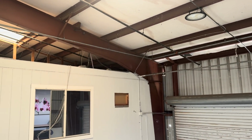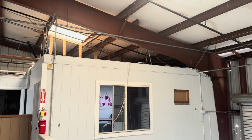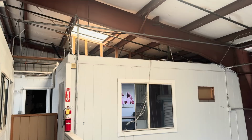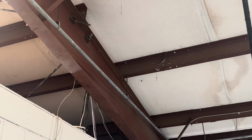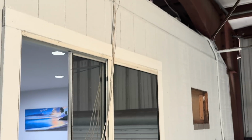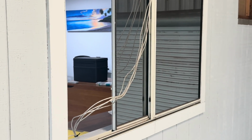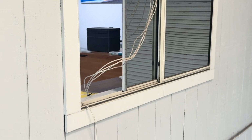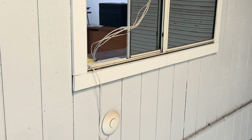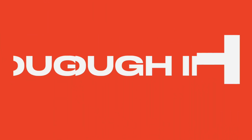So one of the important things that I train installers to look for is the shape or outline of the rooftop structures. When you run wires, you want to trace the pathway that's created by the interlocking girders and conduit. Your cables will take the exact same paths, usually at right angles, so that everything looks clean. Drooping cables is not acceptable.